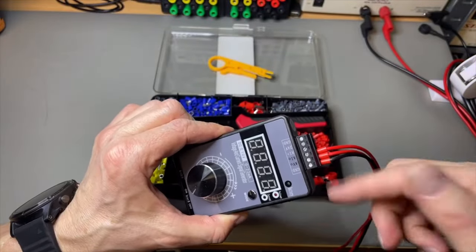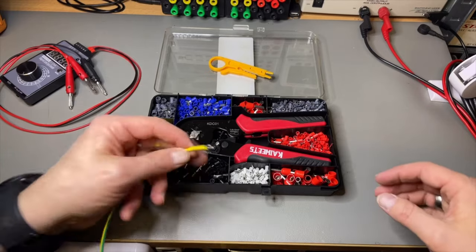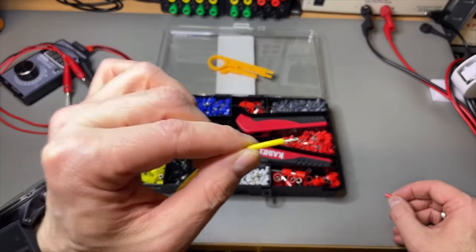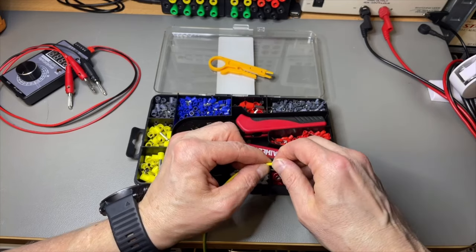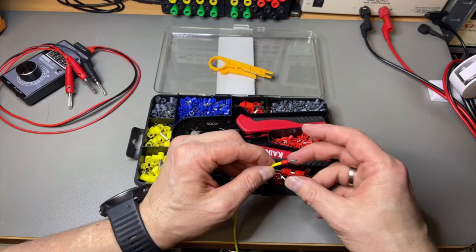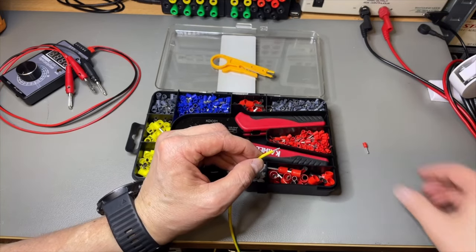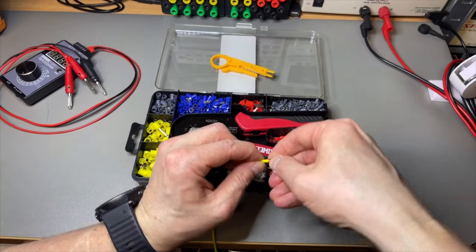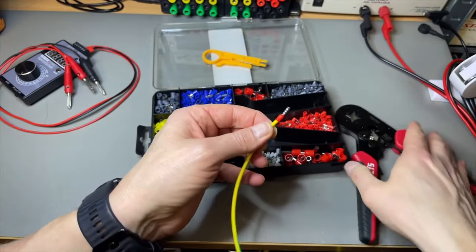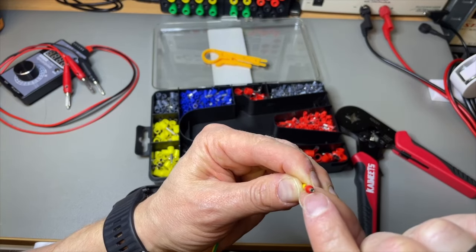And before, it had all these little wires with copper going everywhere, sometimes even making a short contact. The thing I did wrong in that video, the viewers told me, is you need to strip the copper part long enough, because when you push it in and it doesn't come out here yet, it needs to go all the way to the end to make sure that your contact is all the way in that little pipe. And this is too short because it doesn't go to the end, so we need to strip actually a little bit longer, and then you push it over, and then with this nice tool you hold it and it will find out the pressure itself. And look at this. But again, this is wrong because the copper should almost go out or be exactly the same length.